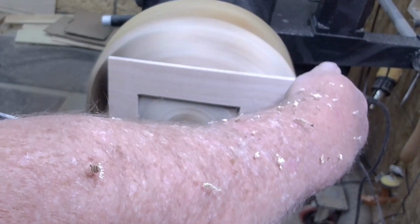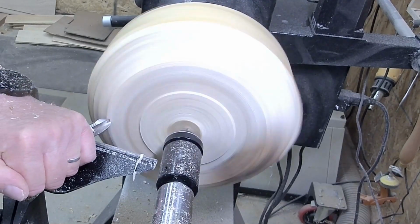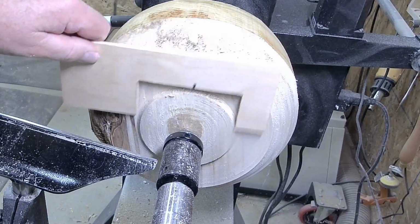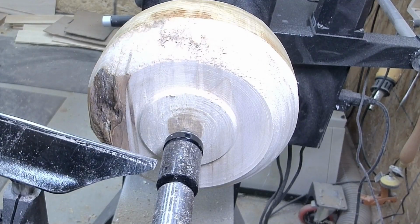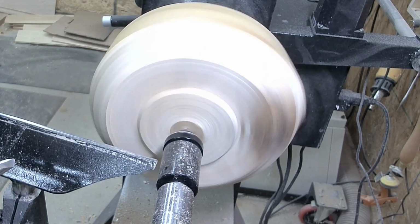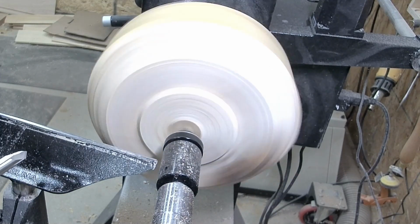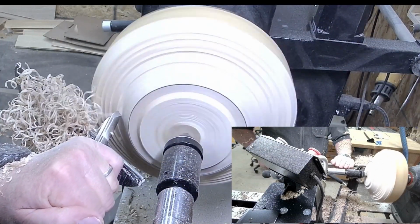It had a pretty heavy divot in the bottom, so I had to make the bottom of the bowl narrower than the top. Just saw there's this little plywood jig. I'll use that to get the size of the foot for the 150 Vicmarc chuck. I like to keep the bowls with at least a 5-inch foot on the bottom. You can then decide whether to keep part of the foot, all the foot, or none of the foot, depending how the bowl turns out.